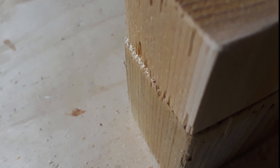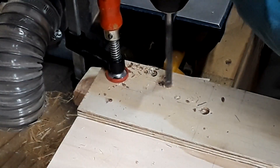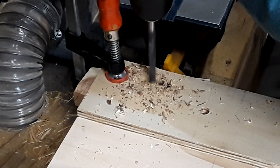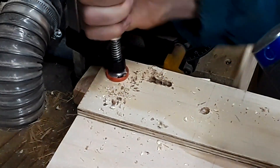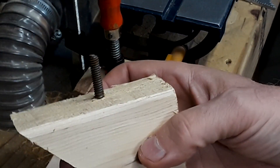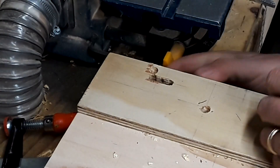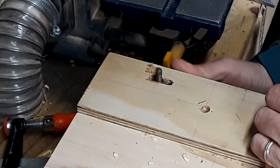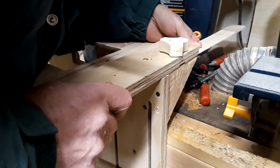Another problem that bewitched me for the longest time was lining up my mortise and tenons. Forward and back, side to side — that was no problem — but I couldn't get rid of the twist. I finally realized that being able to rotate the top might be the answer. The top board attaches to the upright with two screws; taking one screw out allowed me to slightly rotate the top. The gussets were 3/4-inch stock so I changed them to 1-1/2-inch stock and sunk a hanger bolt in each. I cut slots in the top to allow the hanger bolts through and then made knobs to secure them down. A little glue on one side of a shim allowed me to get the top back perpendicular to the upright again.